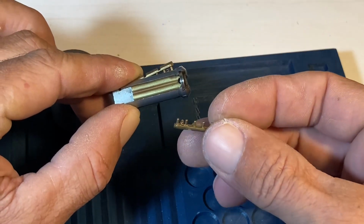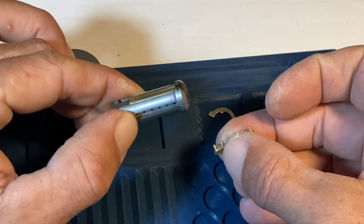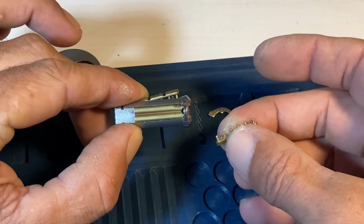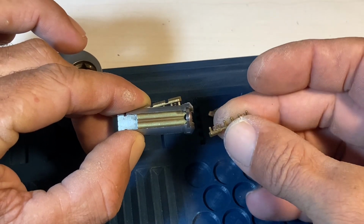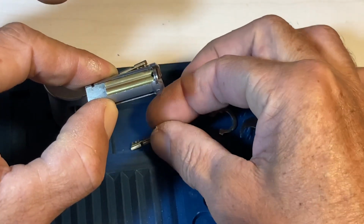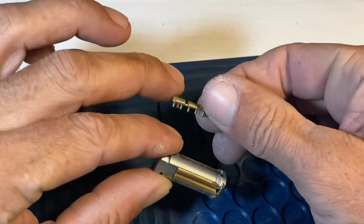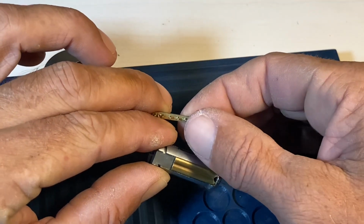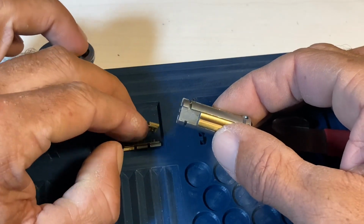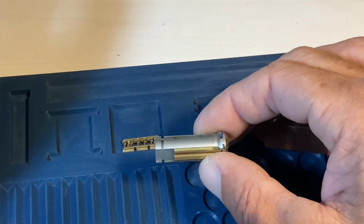As you can see, there are 6 fingers on each sidebar. What these fingers do is actually poke into holes through there and engage slots in the side of the key pins. So without those little pins on the sidebar, the pick's not valid. And they're proper sidebars. I can show you the sidebar. Springs are there, pins are there, or fingers, or whatever you want to call them. So those sidebars are correct. What was that? That was the core.